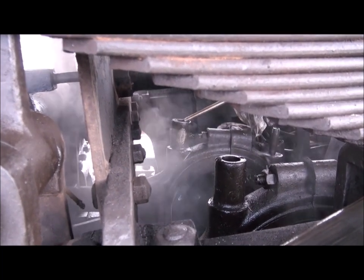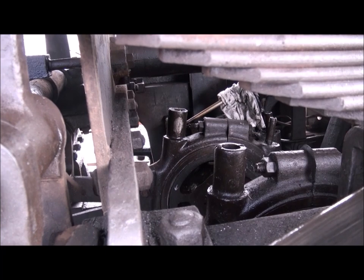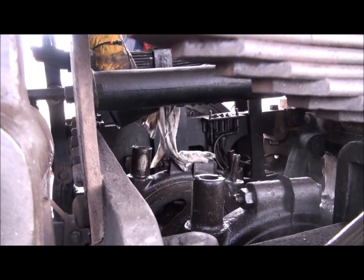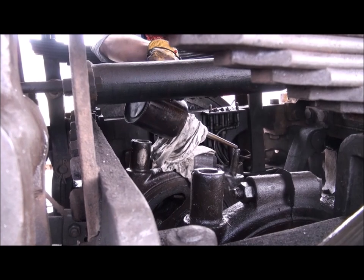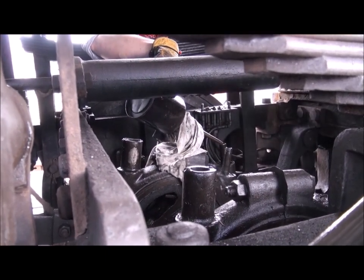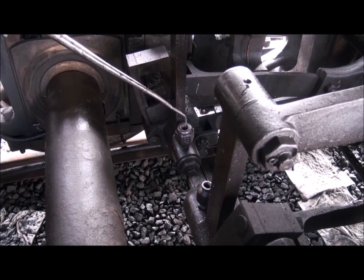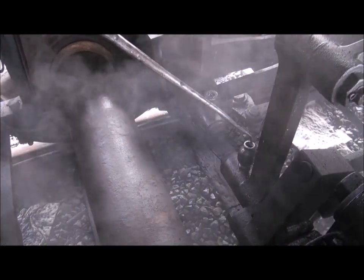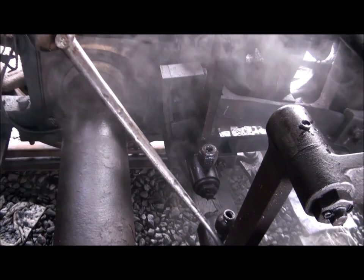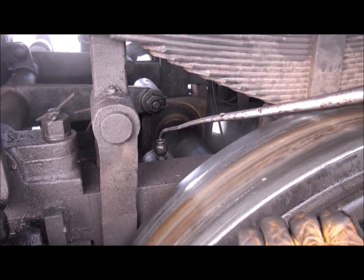This is part of your valve gear. In this part of the valve gear, there are four places to fill with oil on each side — two here, and then you turn your can around and go for the other side for two more. You just fill these tubes all the way up. Then you move forward to the other section of the valve gear. There are two little cups way down low. Generally you can reach both of these at the same time. Then you want to put some oil on the sliders that go up and down. There are also two cups up higher on each part of the valve gear assembly.